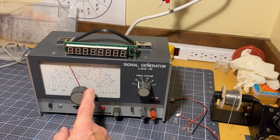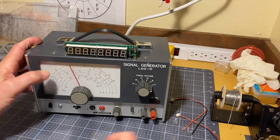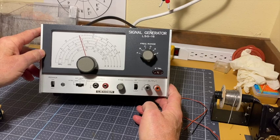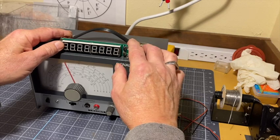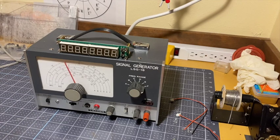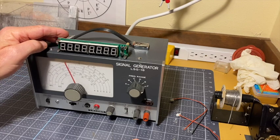It measures up to 60 MHz, and the signal generator is theoretically capable of outputting 60 MHz. If you go to the F band over here, 30 is about here and 100 is about here, but I think they're doing it with harmonics and not with direct generation. The project is to add this — I'll design and print a 3D case for it so it doesn't just sit up there. I've got some red acrylic I'll put across the front so it looks nice, and we'll hide the electronics in a 3D-printed plastic box.